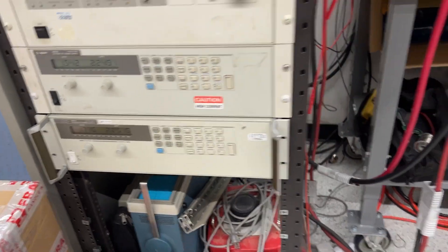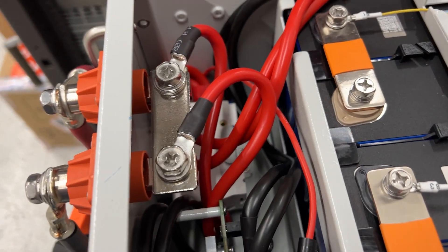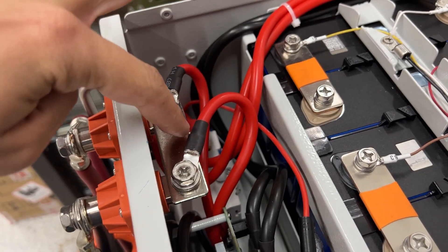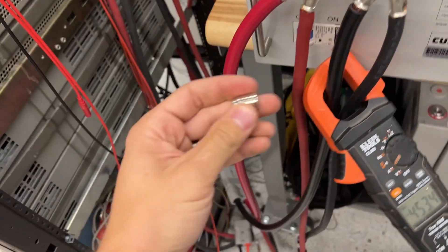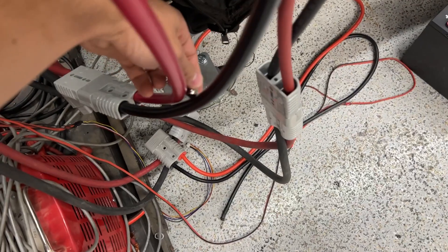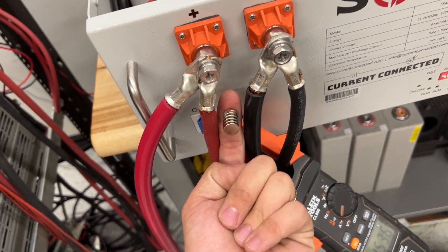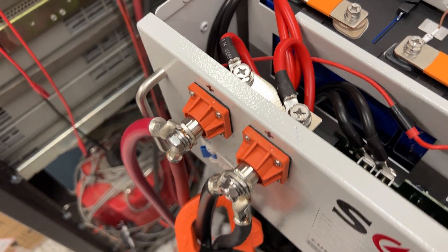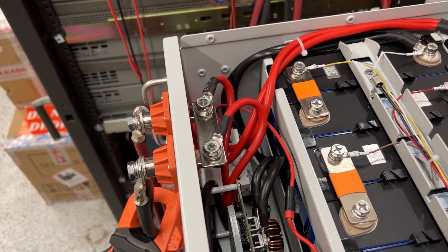I ramped this up some more — both supplies are maxed, 450 amps going through. I don't see any problems yet, so it definitely has the surge capability. It is getting a bit hot, but then again this is 450 amps. And this point right here — when you have 450 amps, this is a neodymium magnet — the copper literally becomes magnetic. You can see it got stuck here because it's attached to the copper in the wire. Some serious fields right here, especially with a magnet. But 450 amps so far is still not really a concern. Although I wouldn't necessarily run 450 amps continuously through here, it still is within reason — nothing too crazy.